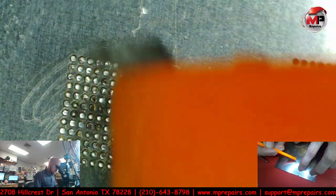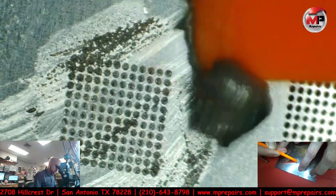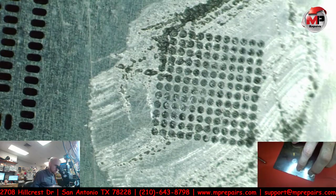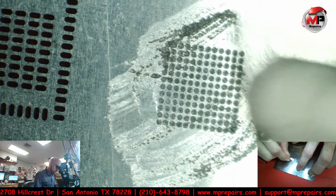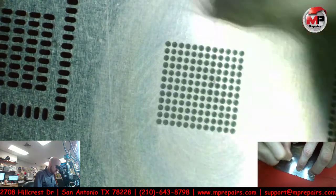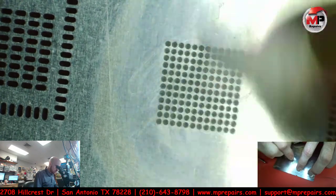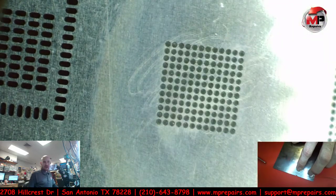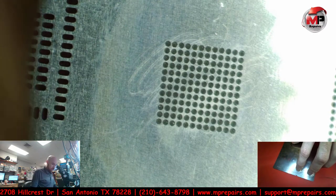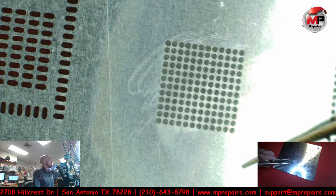Now, if this audio IC issue doesn't fix the problem, my next thing is going to be the selfie ribbon cable. Being that the LCD's been replaced, I've seen those cause the same thing, even the home button. The iPhone 7 is so picky when it comes to these things. iPhone 6 and below, I should say, anything below the 7, you could practically rip everything off the board and the phone would still boot. This one, not so much.